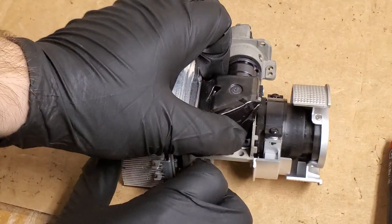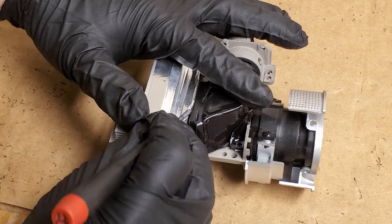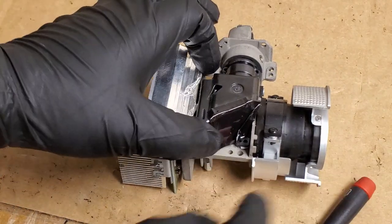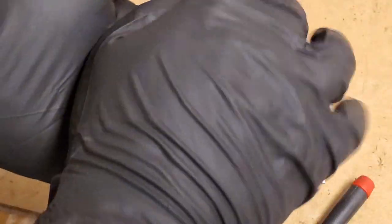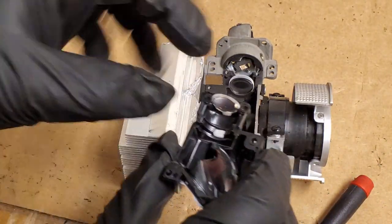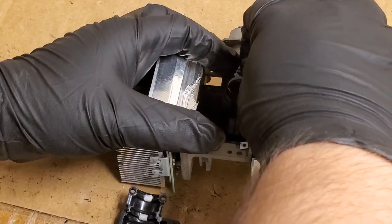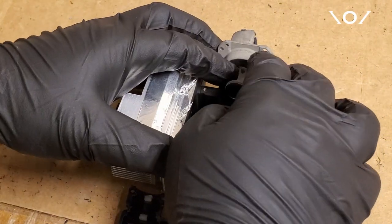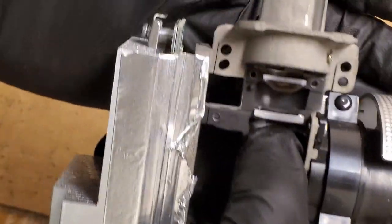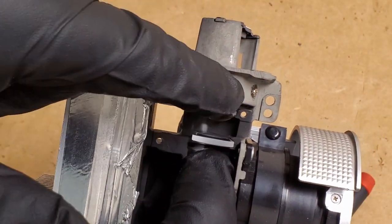Put the screws in the thing — there's the integrator. I think we'll go through the bottom. What I will do is loosen these screws and lift them out. When we take this off, we're going to be extra careful because there are some lenses in here that can fall out, and if they get out of order or face the wrong way, that can be a problem. One lens did come up with it — this lens here is supposed to come up with it, pretty much, but not this one. This lens goes here, round side in. For future reference, if anybody ever takes one of these apart and you forget: round side facing each other — the bump on this lens and the bump on that lens pointing in. And then there's the shape lens.